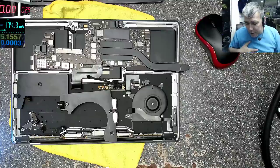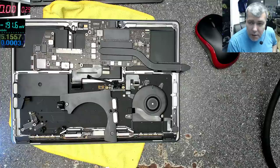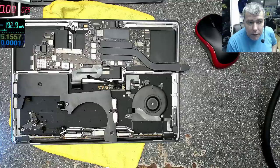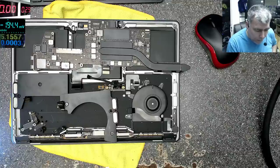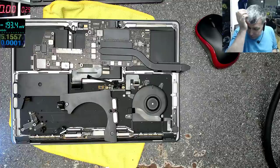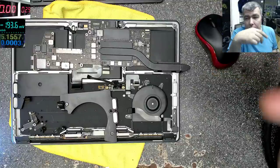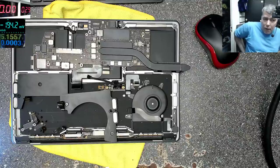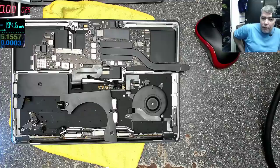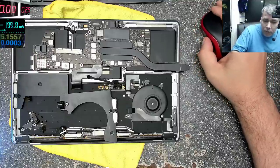Usually we are not using schematics for a normal laptop, but not on this one. So Jason bought the schematic, and let's start fixing this one. This is his personal one, so we have to help him. One more thing: I checked if I have 3.3 on the keyboard connector, and I don't. That means something is gone there, some power supply, or something is shorted, I have no idea. But I will open the schematics now.